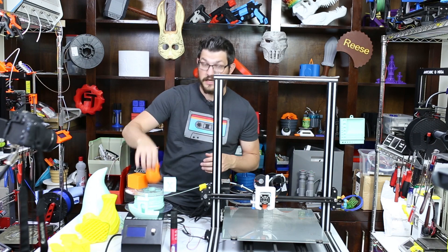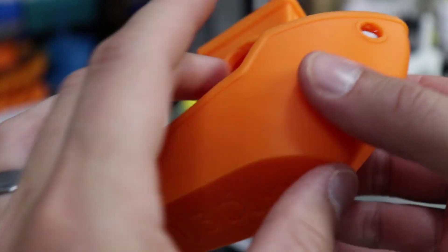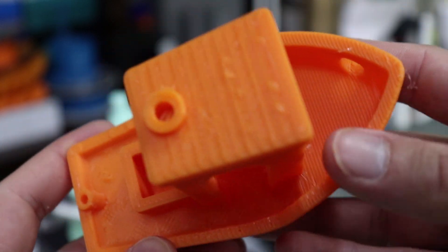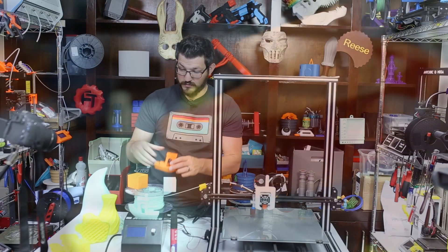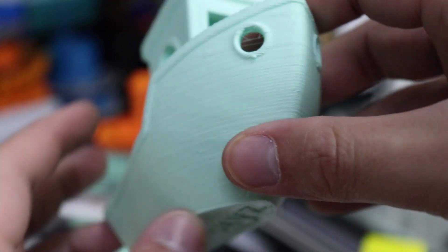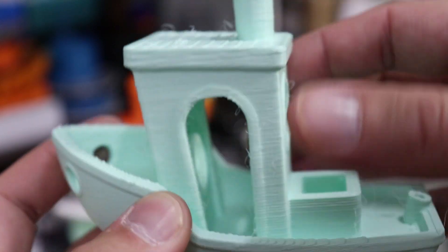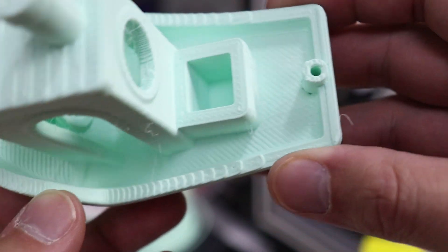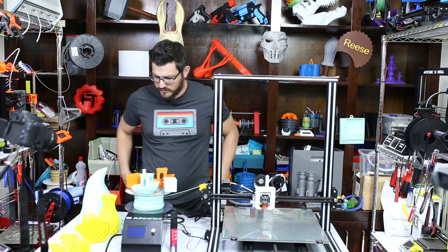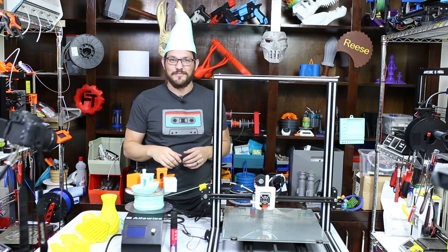Once I kind of figured out all of that I started printing a couple of the benchy's. The bottom layer of the orange one was fantastic and I actually posted this up on Twitter. This one turned out to be great but top layers were not perfect, so I went ahead and printed it out again using the Filament One mint filament. This ended up being much better — solid walls, I was able to get the top a little bit better. A little stringy so I was a little off on temperature but I was able to get the top layers filled in. The smokestack finished this time — it didn't finish on the orange one.